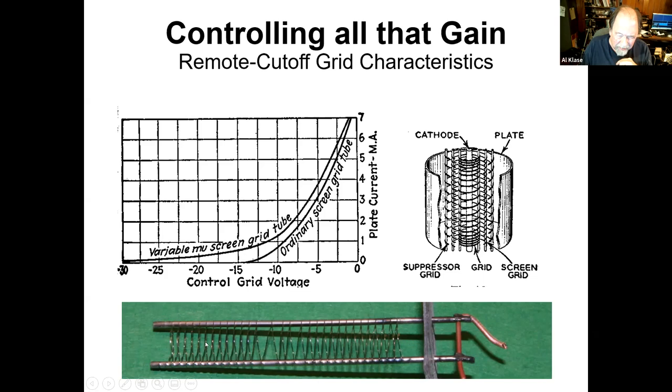grids are usually evenly spaced, but you get toward the middle of this one and the spacing widens out for a while and then goes back to being tight. And what this does to this curve is as you pull the control grid voltage down, instead of cutting off back here, this curve comes way down here, and you can see the very gentle slope here. It cuts the gain way down. So you have electronic gain control in these tubes, and that becomes important for automatic volume control